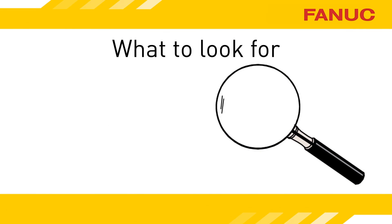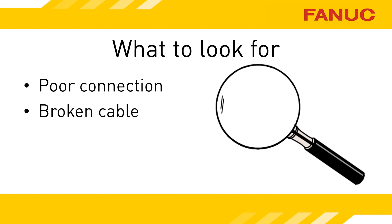Once you've identified where the trouble is physically, try reseating the connectors on the fiber optic cable. The FSSB cable is transmitting light — while not a scientific test, touch one end of the cable to the business end of a flashlight and compare the light level coming out of both conductors. Is one dimmer than another? Check a second cable to compare. You can also swap the fiber with another drive unit to see if the problem moves. It's possible the logic board that the fiber optic plugs into is bad. If you have multiple servo or spindle amplifiers, you can probably swap the logic board with another amp of the same part number, but be aware you stand a chance of losing home position if you unplug feedback cables from a servo amplifier.